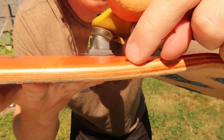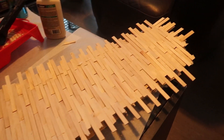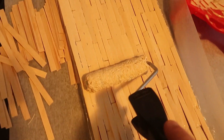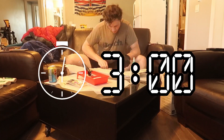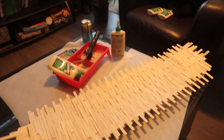Skateboards are typically seven layers, but I'm going to make mine nine layers because it's made of popsicle sticks — I want to make it a bit more beefy. I'm going to do seven layers one direction and then two layers the other way to keep it all together. If this peels up again, I'm going to have to start all over, so I really hope that doesn't happen. It's actually working, so I want this to be very, very strong — I'm just going to load it up with the glue. The glue is even stronger than the wood. I've already used one container of glue and we're now on layer four, with five layers to go.